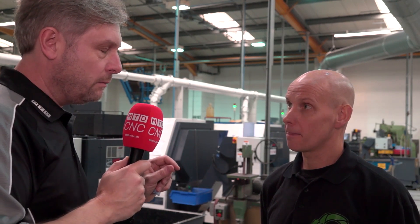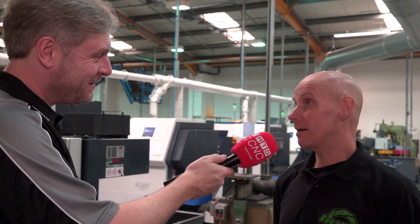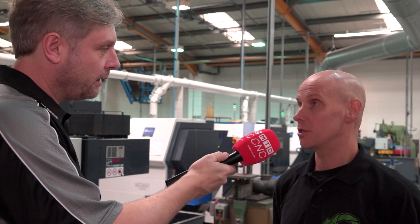A great example — is it the barrel that goes on for the rear chain? Yeah, that has two bearing diameters that have to hold a very high tolerance. And once it's settled down in the morning, it hits that tolerance all day long without having to touch it. You're not hammering the machine to move really fast and really hard, but you're getting that accuracy. That's basically what we want — we don't have to chase times, so we'd rather have it running well.